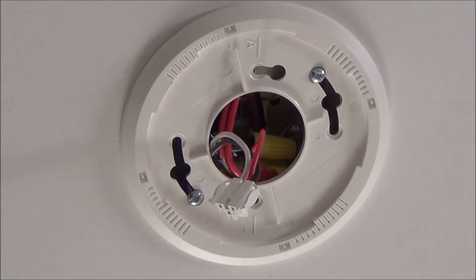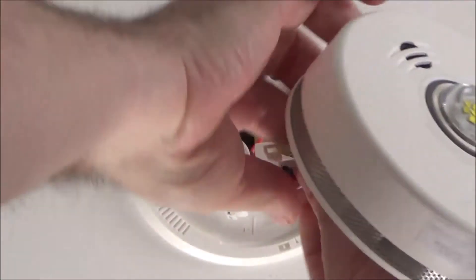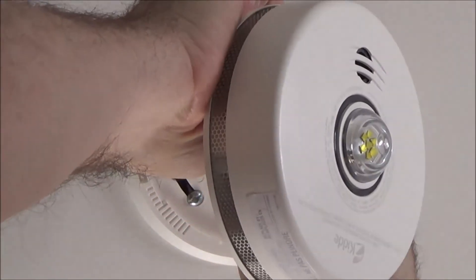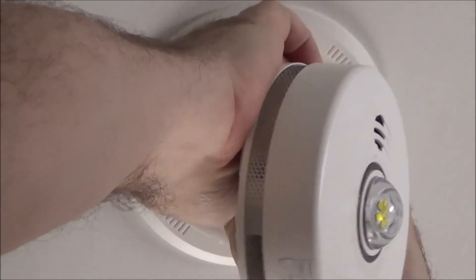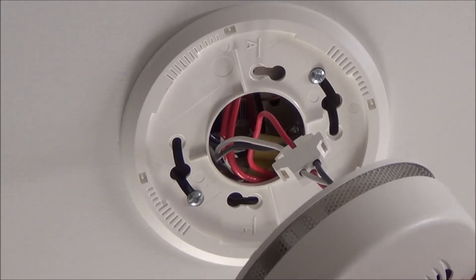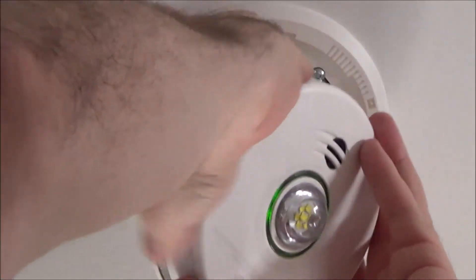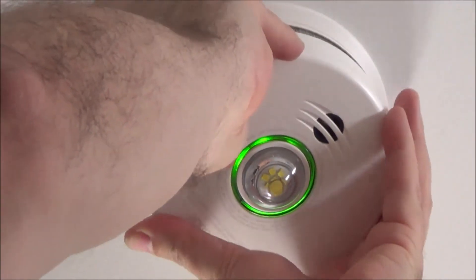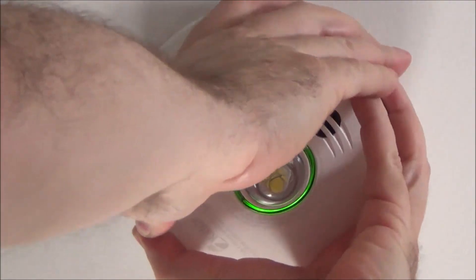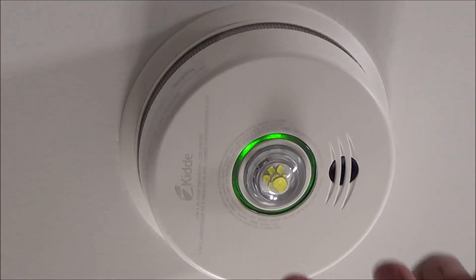Here's the installation. Even though it has a 10-year battery backup it works without it, but once you connect it — nice little clip, it's in there nice and firm — this alarm is now connected to all the smoke alarms in the house, so if one goes they all go off, which I think is brilliant. Now this should just fit right in there — line up the tabs and give it a half-twist. There we go, that's it. Green light is on.